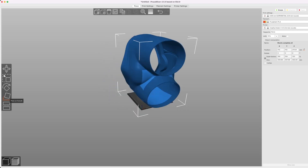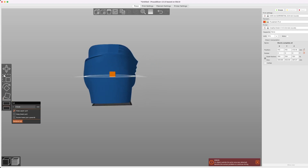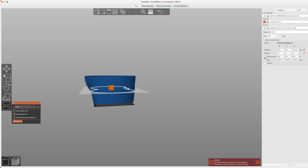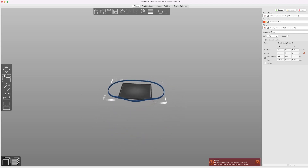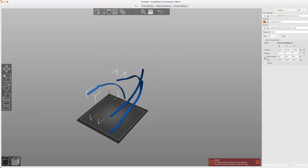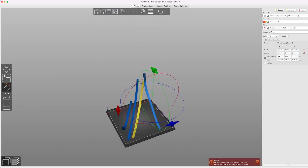We're going to use Place on Face to make it go upright. Now let's go over to the cut tool, and I'm going to eyeball where the widest section of the rear is. Keep lower only. Then we're going to make another cut — uncheck keep lower part and check keep upper part. So now we have a measurement for the widest point of the rear end. This is still too big to fit on my printer, so I'm going to cut it into four different pieces, get those all nicely lined up, and export as an STL file.